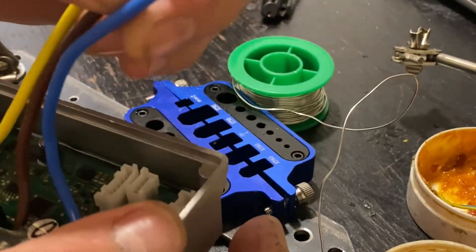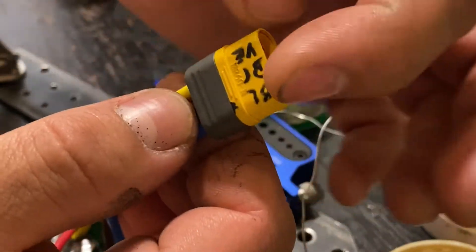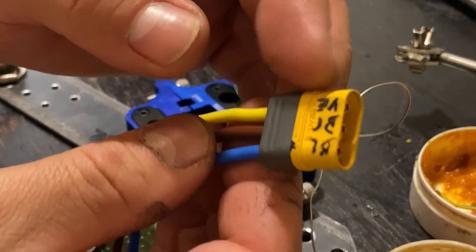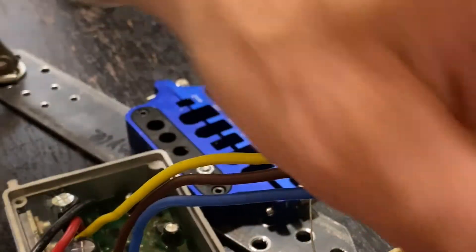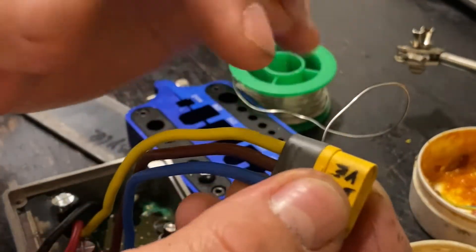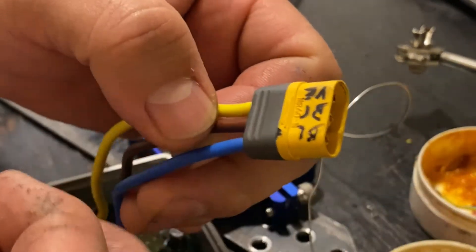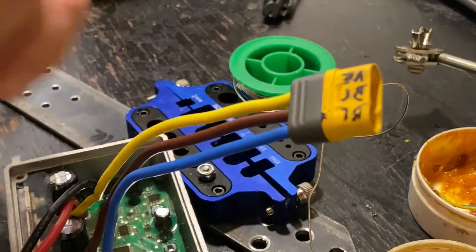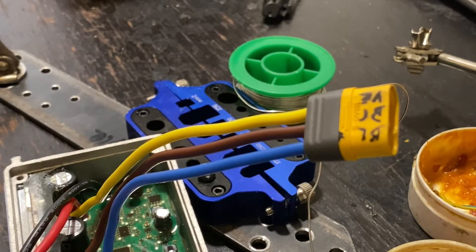As you can see, the connection is very easy to do. The most important part is not to overheat it, because that will make the pins loose and give you possible errors. Repeat the same process I just did with the motor, making sure you match the wires. I guarantee these connections will not fail — just follow the steps so you have a successful installation of your MR60 connectors. Remove the component from your scooter so you have a good vision of what you're doing, not exposing the battery or any other components.